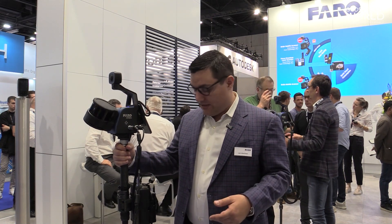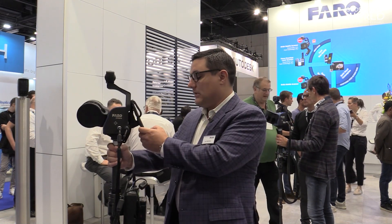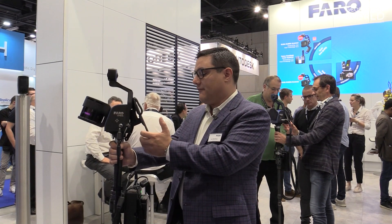With the Orbis we have flash mode. Any area that you want more detail, more precision, more accuracy, you can stop and create a flash scan from the mobile device. In 15 seconds it creates a more detailed, higher precision scan of that local area. As you're walking you can capture that additional information, or you can get flash scans all throughout your building and stitch them together just the same way that you would with your terrestrial laser scanner.